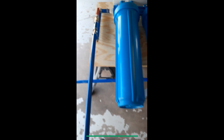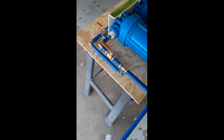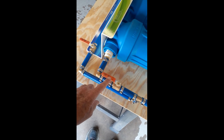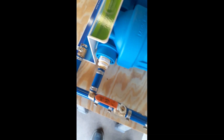Now I'm setting up the PEX bypass and direct feed. This is the feed into the system — this will be the inlet valve, this will be the outlet valve. That's the bypass cutoff: when you turn this valve and that valve off, you can run the bypass to change the filters.